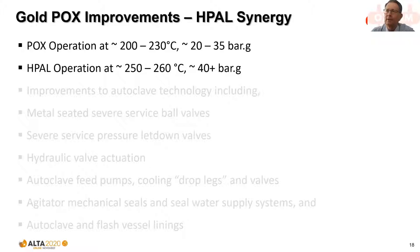In terms of developments relating to the potential for improvements, one important thing — particularly from a West Australian context — is the synergy with HPAL operations. HPAL is the technology for acid leaching of nickel; it operates under more forcing conditions with no oxygen involved, but has been driving improvement of the physical equipment used for pressure oxidation as well as pressure acid leaching. Here's an example of a HPAL circuit whose key ingredients are very similar to what we might find in a POX circuit.